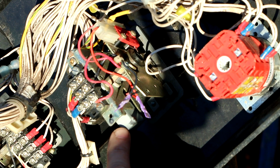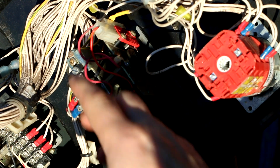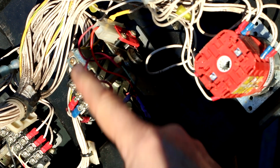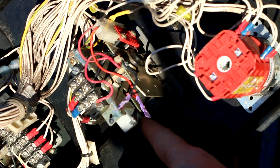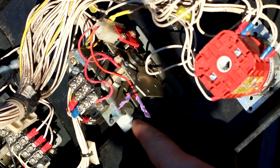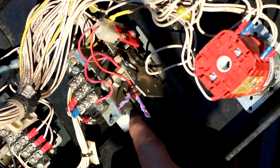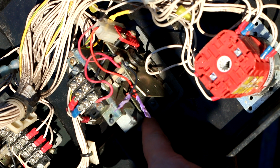So here's the back of one of these digi sensors. This happens to be the one that I put the new micro switch in, the joystick for the boom. That's the new micro switch I put in. And there's the digi sensor. And these two bumps right here that I didn't even realize what they were before are actually LEDs that are potted in there. So when I actually actuate this thing, those LEDs should actually move.